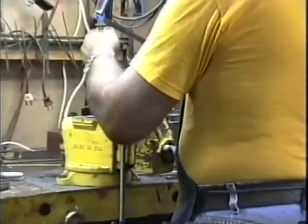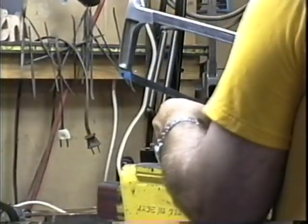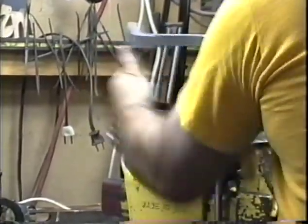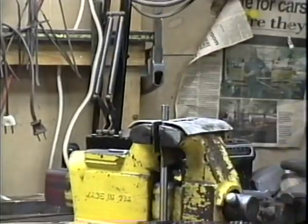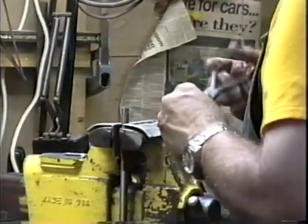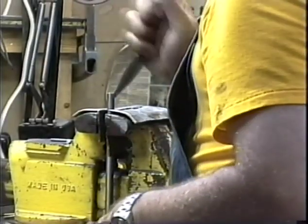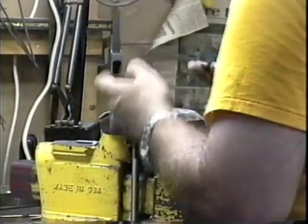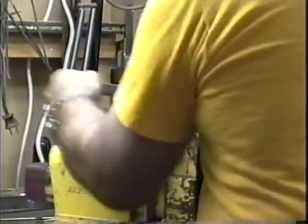This is pretty much a repeat of what we did earlier. We're just going to cut a couple slots, straight down about 8 millimeters, and then grab my trusty needle nose pliers, which are hanging up on the floor, and break those pieces out so we have a nice wide slot. For this one, I'm going to be using my 8-inch flat file, and we're going to widen that out first.